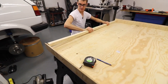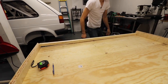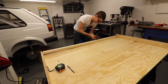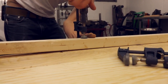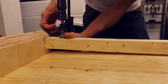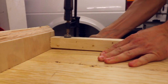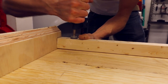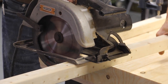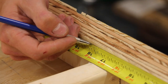I'm trying to keep this kind of on the cheap. Even though I've used decent plywood, I just ran to the store and picked up some 1-by lumber — made a little late-evening Lowe's run — and we're just going to chop this 1-by up. Since this tabletop is bowed upward, I'm going to cut the pieces and flip them so the two pieces are bowed opposite, then clamp them together and screw them, and hopefully they'll negate each other. I'm going to guess that won't do much because this plywood is pretty sturdy and this 1-by is absolutely terrible — just a twisted heaping mass of one-dollar wood.